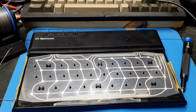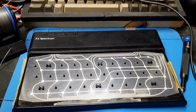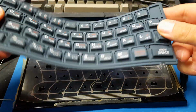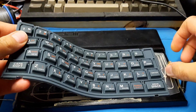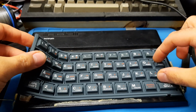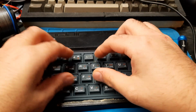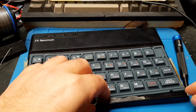Cool, I'm just going to pause while I clean these last two bits off. So now everything's been cleaned. I used some IPA to allow me to dry the water off a bit easier. A little useful tip and trick is when you've got something wet, spray it in IPA and then dry it. Because the IPA will displace the water and it evaporates a lot faster than just plain water. Make sure that fits in the little seating bits I've just spotted.